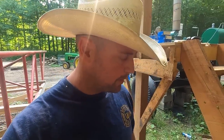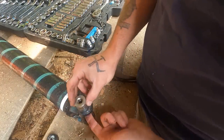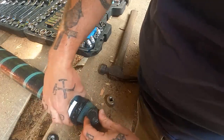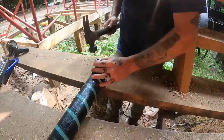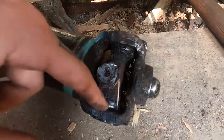There are a couple of different ways to take U-joints apart. You've already seen me do the first one before — you get a socket that's smaller than the size of the cap so that you can just drive the cap in. Keep in mind there are several different locking mechanisms, but right now the rest of the U-joint is gone so we should be able to just drive this through. Now, these on the tail shaft are just press-in basically — held in place with friction and some load-bearing paint. These however are a little different; they have an internal clip.